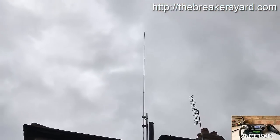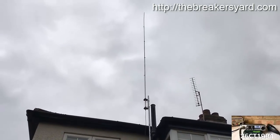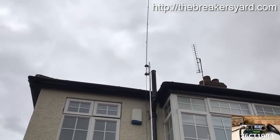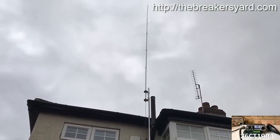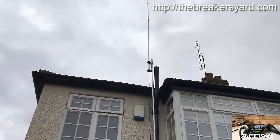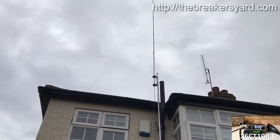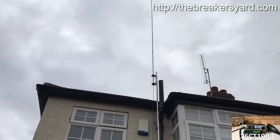It turned into more than a ten-minute job. I've been spending 20 minutes or so faffing around with a SWR meter and I'm not happy with the results at all — not quite in the red but well above two. So things aren't right, and I suspect it's my patch cable. I'm going to have a route around for that, but I've needed to put the aerial back up roughly adjusted, because the weather's on the turn — the wind is up and it looks like rain's going to come fairly soon, so before I get all wet I'm going to go back indoors.